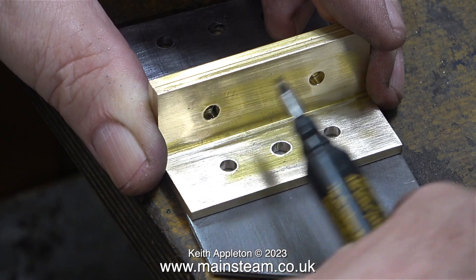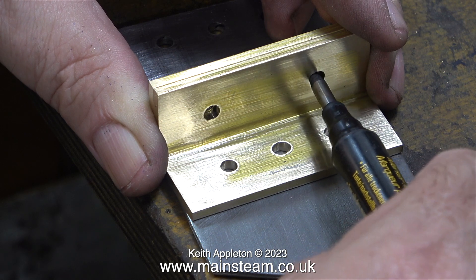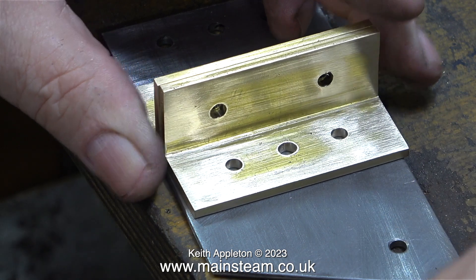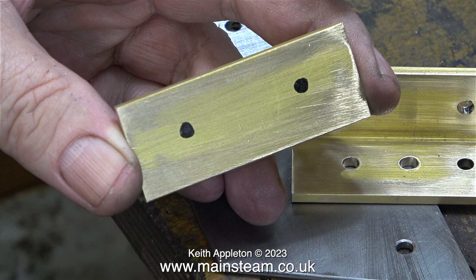What I'm doing here is holding both of the brass parts together and marking through with my deep hole marker so I can drill the other brass part. Once again this is not a very scientific method but it's quick and it works — that's why I'm using it. Now I have a felt tip pen mark on the other piece of brass and all I need to do is centre punch the very centre of the black spots.